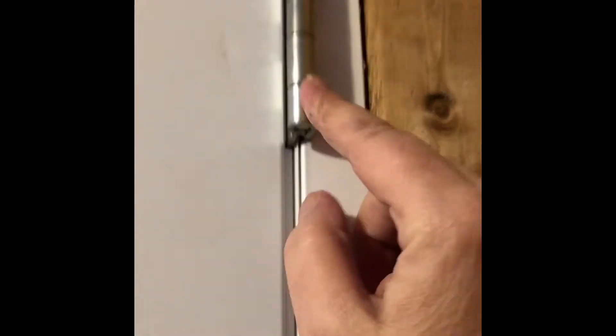There are about four ways I could fix this. I'll check here — go all the way up and see if it's a tight seal all the way. You can see how it's on a tight seal there. So I can pull the top of that door over, and there are two ways of doing it — or more. Take the pin out of the hinge, and when the pin's out, put on a pair of pliers and just move the ones that are on the jamb — not on the door, on the jamb. Just move them a hair — all you need is that much. When you put the pin back in, the door's going to be over farther up at the top.